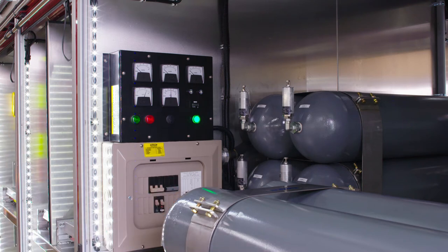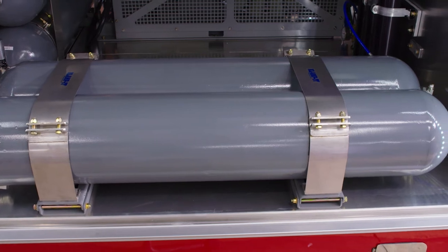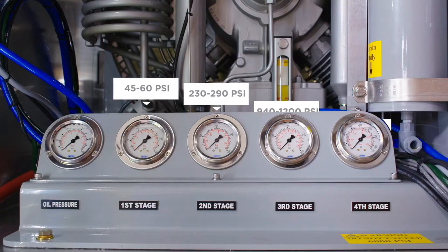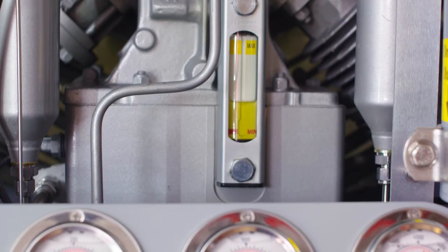When the compressor is started, the cooling and intake air will be drawn from the driver's side of the truck over the two ASME cylinders. This will require both doors on each side of the truck to be completely open. This compressor has four stages; each gauge must fall between the indicated PSI levels. Proper oil level is important and must be below the top of the sump housing.